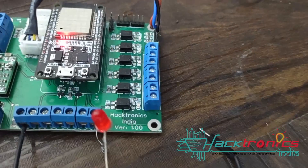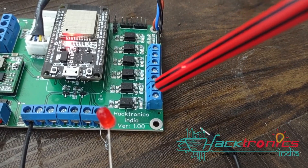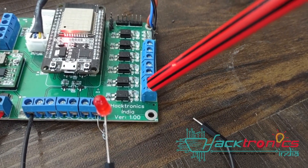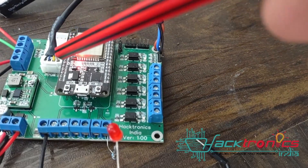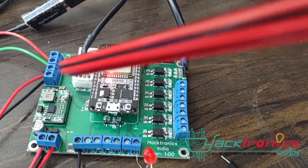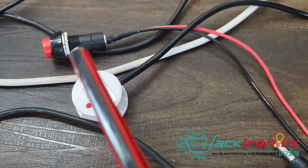The tea coffee machine panel buttons are cut and placed here. The button input goes here and the button output is connected here. Once you connect the button input, it does the processing, and once the payment is accepted, it creates a pulse on the button output line which goes to the tea coffee motherboard and dispenses the actual beverage.